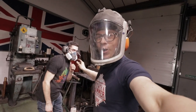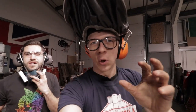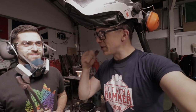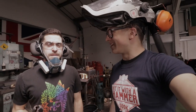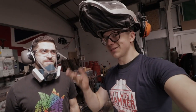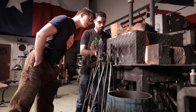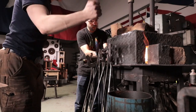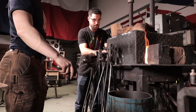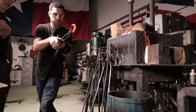So that's now going to go back into the forge. We're going to heat it up until it's red — that's often called critical temperature, it's where it becomes non-magnetic. Cooling it down very rapidly — that'll then harden the steel, and flint strikers like to be hard metal so we're going to harden it. You're going to take it with the tongs into the oil, shake it up and down slightly but make sure it always stays below the surface of the oil — we're going to make it half a foot deep. And in we go!